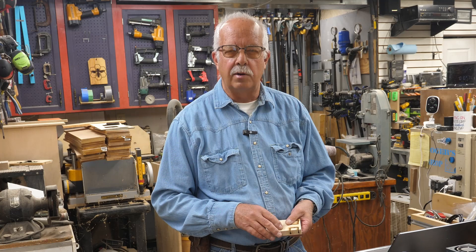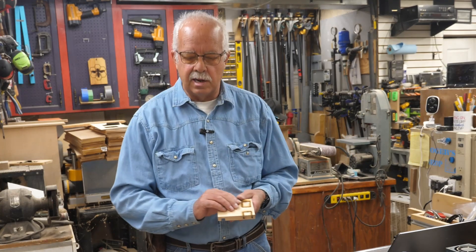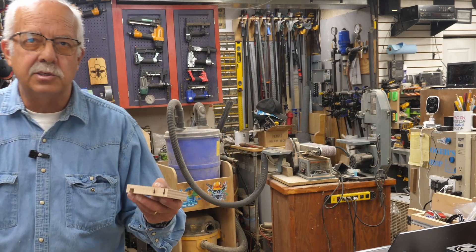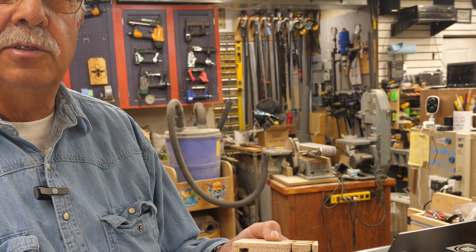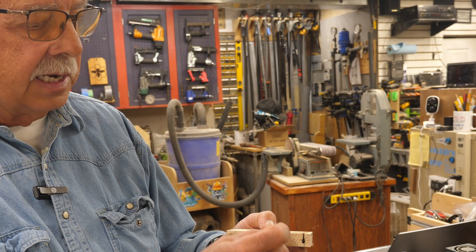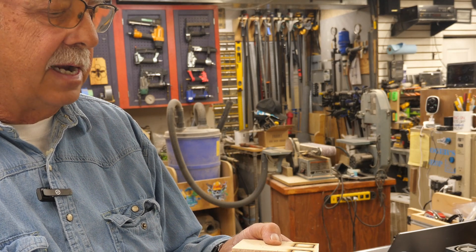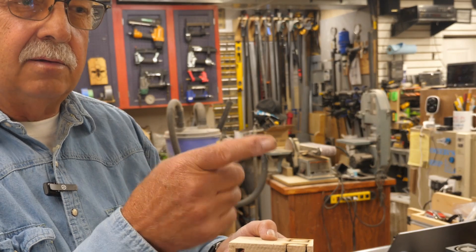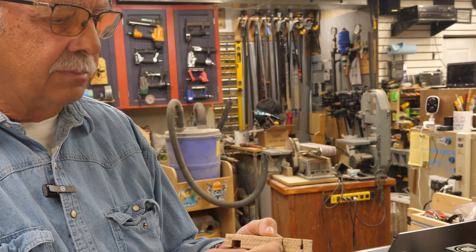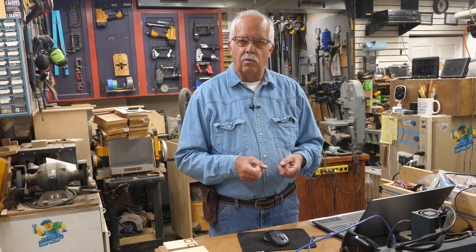I did some experiments with hardwood plywood — not the cheap stuff, the good stuff. I went with 8 passes at 100% power. This is a cutaway view showing how far I got through. The problem with cutting really thick material with a diode laser is that as the beam goes down it gets out of focus. Unless you can constantly move the laser head down, the beam gets wider and the piece you finally cut out will have a concave, burned side. So that doesn't work too well for 3/4-inch.